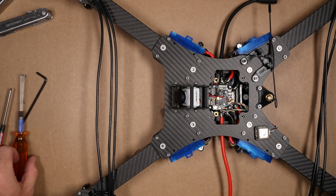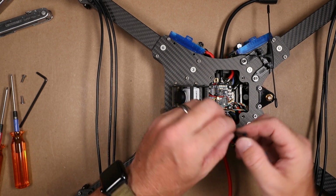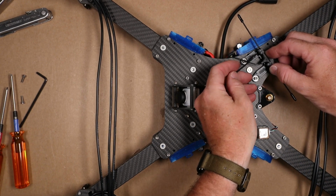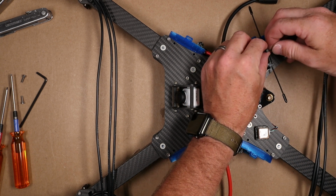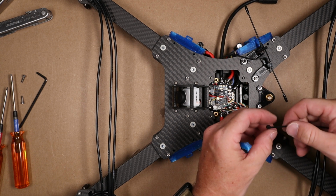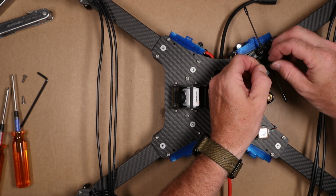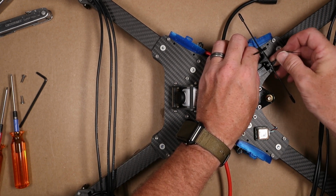Okay, once those are set, these are 4-inch zip ties. The way this works is we put our crossfire antenna like this, and you can see a little slot right through there. We zip that through there, bring it across the top, and give it a couple clicks. Same thing with this one: stick it through there, bring it through, and cinch it down a little bit. Then we can position our antenna, hold it in place, and cinch these guys down.